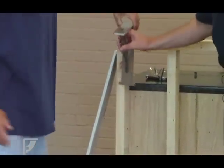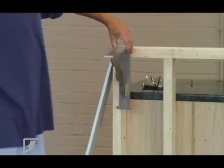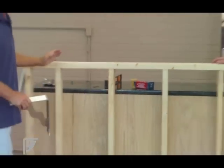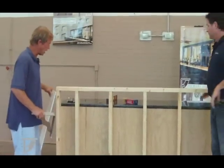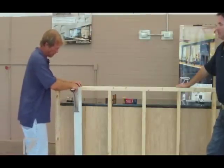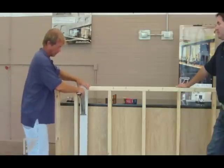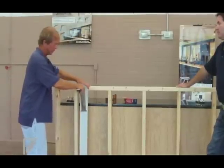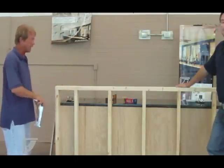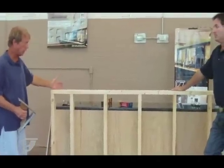You want to install it properly — and turn it the right way, that always helps. You can put it on the edge or anywhere. The problem is that when there's just drywall covering over top of it, unless the bracket is directly over a stud, you're going to run into problems with the bracket wanting to flex the drywall. That can't happen — it'll snap and the granite will want to fall off.